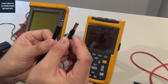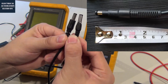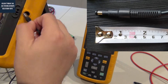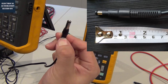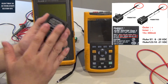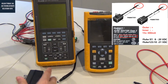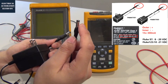You can use a knife to cut it and make it smaller, like my connector. I cut this and made it smaller. Because the socket is very deep and it has a cover outside, it will basically use 30 millimeters — so that length is about 30 millimeters. That is the DIY power supply. You can select DC range from 10 to 20 DC volt, select greater than 300 milliamp, and make this connector. Keep in mind the outside must be the positive.